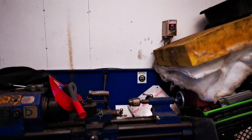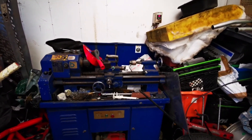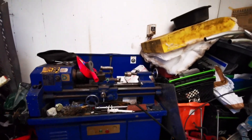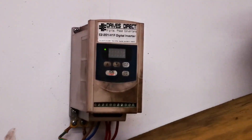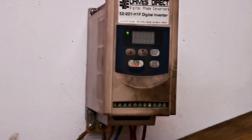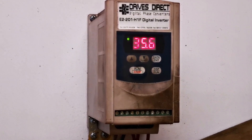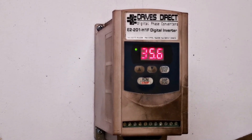You may have heard it mentioned that the lathe is a three-phase lathe with a three-phase motor — it's about one and a half horsepower. You're probably wondering how we're getting a three-phase electricity supply from one phase. The answer is pretty simple: in the corner there's something called an inverter, and that takes the single phase and converts it to three phase. You can see the flashing numbers — it also acts as a handy speed control for the lathe, so you can set the speed using the up and down keys, and that number goes all the way up to 50.